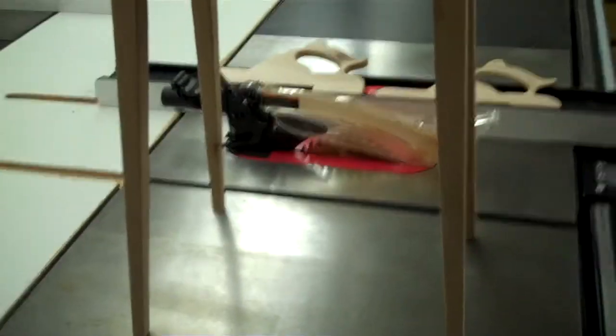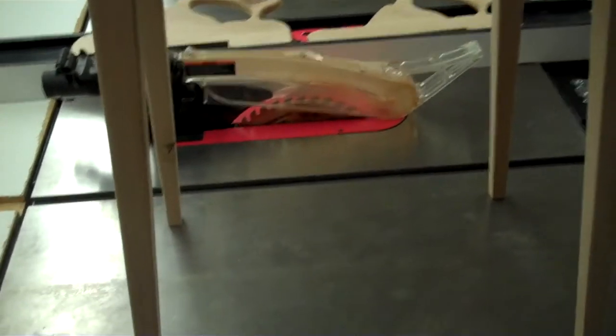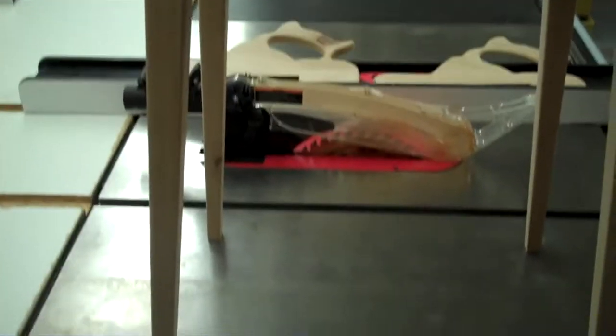Okay, so I'm just coming over to the table saw because it has this nice metal surface that I know is perfectly flat. If I set my table down on there, now I can check to see if it wobbles at all if I put some pressure. Now this one actually is sitting pretty dang perfect. I don't know whose table this is. Oh, it says Mr. Carl's been on that. Oh, yeah, it's perfect.